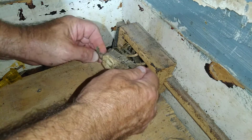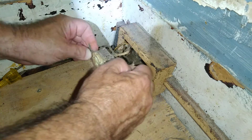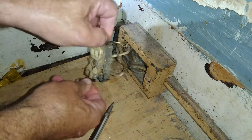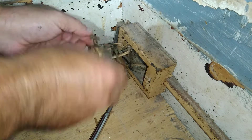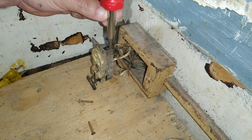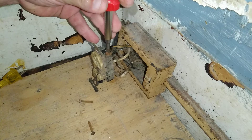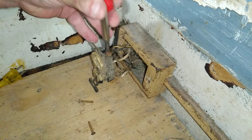As you can see, they back-wired these. Here is something you never do — you never put two wires around one screw. This wiring has been in about 50, 60, 70 years, a little bit old. We'll change it.